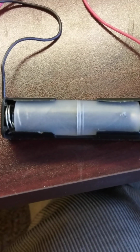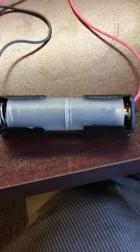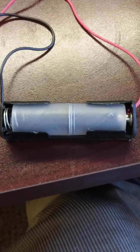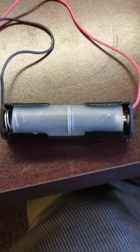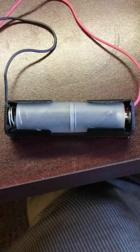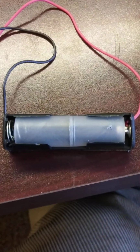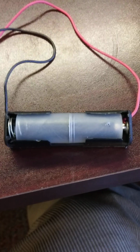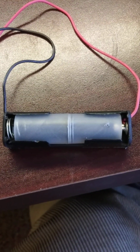dissipate. Now, normally they run organic solvent-based supercaps. Rule of thumb, about 2.7 volts. It's quite arbitrarily based on industrial investigations of supercaps that are commercially available. I'm going to attempt to run them at about 4.7 volts, 250 milliamps. And I want to see the effect.